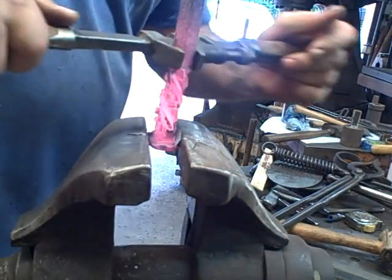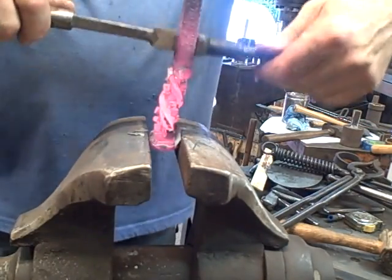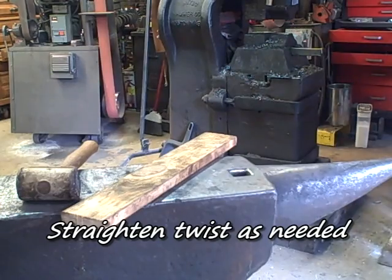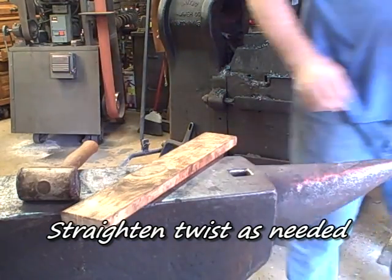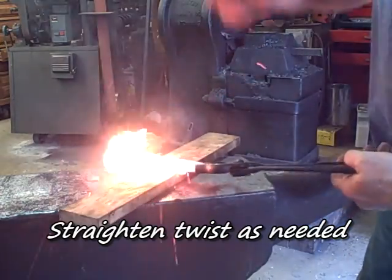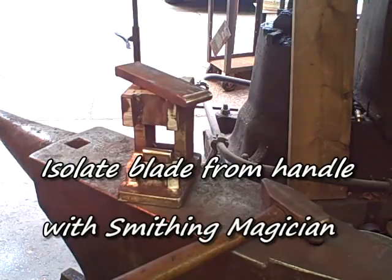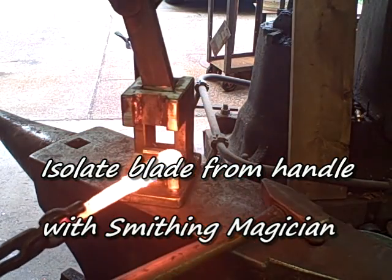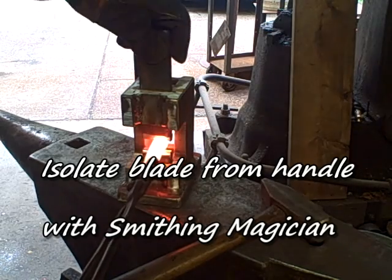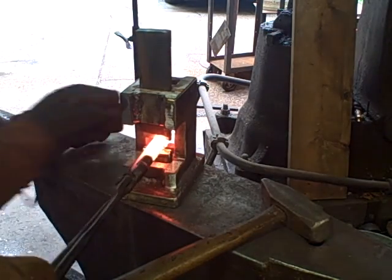This is a 360 twist so that the insert comes back around relative to the railroad spike head the way I want it. If you want a lesser twist than that, you would just adjust where you put the insert. If you have trouble with it, you can use a wooden mallet or a leather mallet on a piece of wood to straighten it.